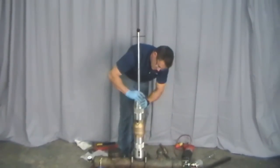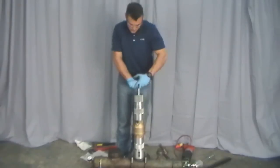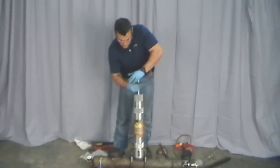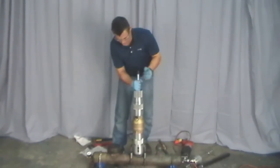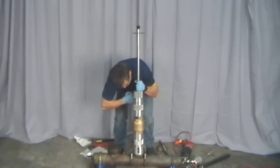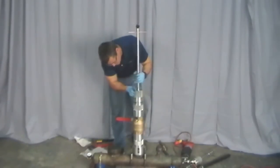With the ball valve in the open position, push down on the T-handle until the plug removal insertion tool engages the square head of the plug. Loosen the T from the coupling. Once you feel or hear the threads on the T skip, the T is completely removed from the coupling. Retract the T-handle so the captured T is above the ball valve. Close the ball valve and bleed off the excess gas. Next, remove the T-handle assembly with the captured T.